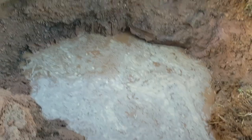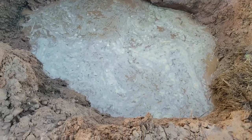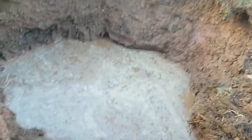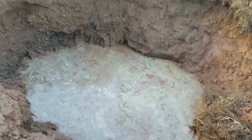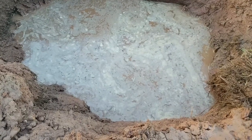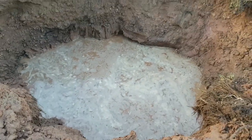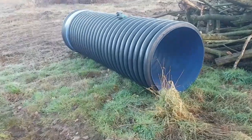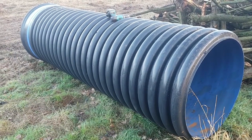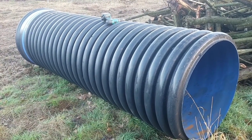Today we're finishing off the well. The hole is about three and a bit meters deep to the bottom, with about a meter and a half of water and a meter and a half above. We dug out the final bit at first light with the digger just before it went back, so no time to film. It's about four meters square and already has about a meter and a half of water. The next step is to get this big pipe, drill some holes in it, put it in the ground, pack gravel around the bottom, and start casing off the edge to make a nice big underground storage tank.